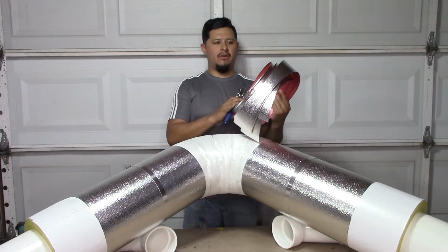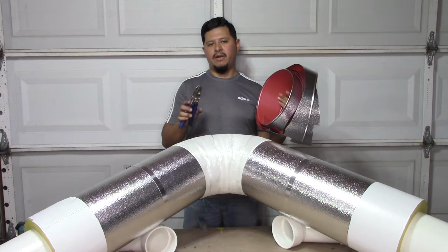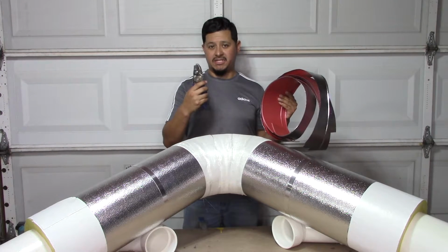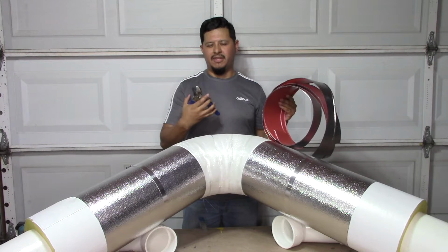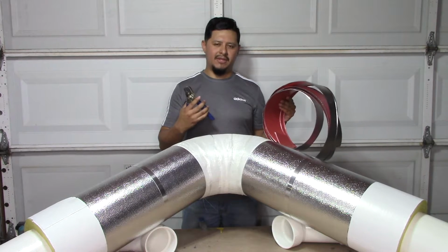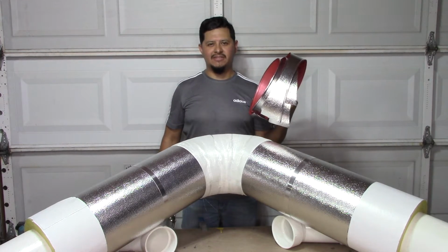So here we have all our gores already made. One more thing, if you don't have a crimper, what you can do instead of crimping it on the side, or if you also think it's easier, you can notch half an inch instead of crimping it. Some of the beaters, they don't have a crimper, or sometimes it doesn't work. So your other alternative to work with is your notchers. And now we're ready to install our gores.